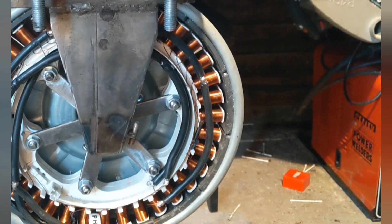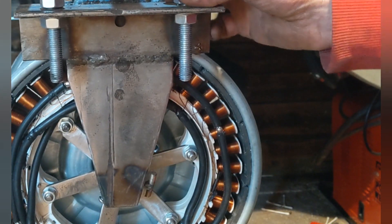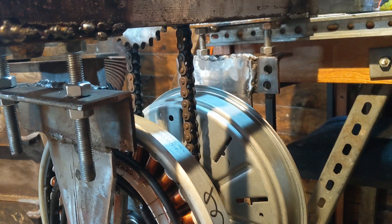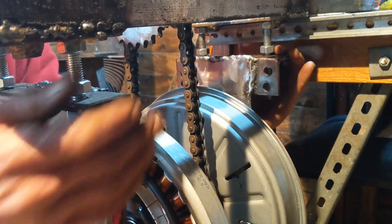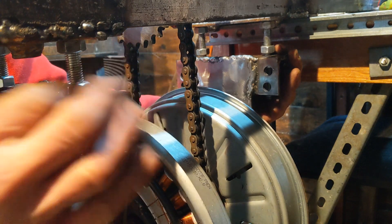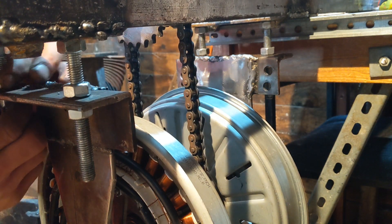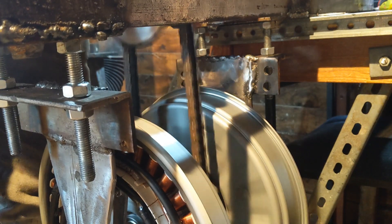Here's how it looks from the front. These are the bolts here that you can use to adjust the plates — adjust the motor up and down — so thereby you can adjust the tightness of the chain. There's way too much slack so let's try and get it somewhere in the middle. That's too tight. Let's get them tightened up — still too tight. A little bit here and a little bit here. I think that's good to go — just a nice little bit of slack, and that does feel easier to turn.